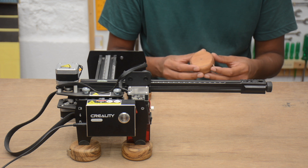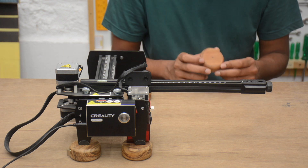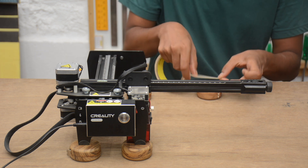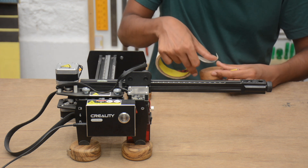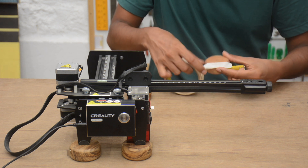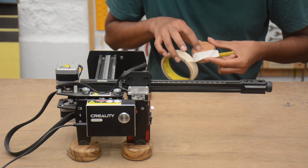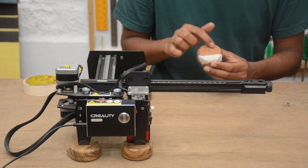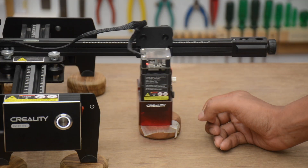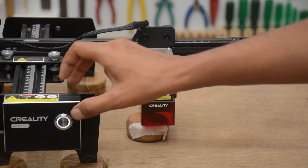For the second tip, when I engrave text on this measuring tape I want my engraving to be parallel to the metal tape. When the tape is rolled in it's really difficult to set up. To do that we will use a very simple trick — I will just pull out the tape and approximately create a parallel line. That way I can engrave my text right along the edge of this tape. I can also do that with a pencil marking but a pencil marking is really difficult to see under the red laser safety cover. I will now use the tape as a reference to set up my work piece, so the engraving outline runs parallel to the tape.